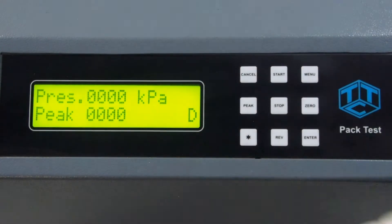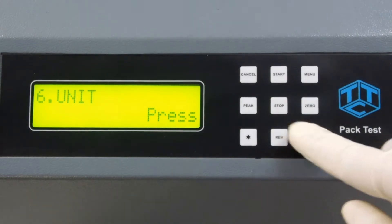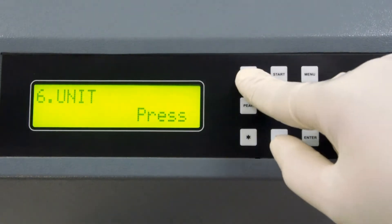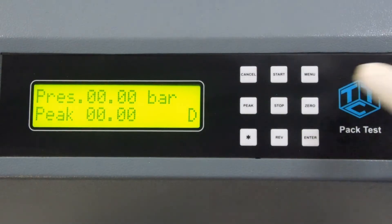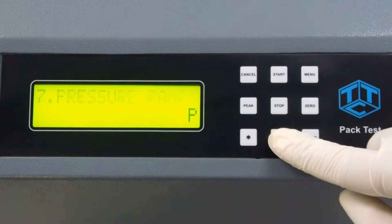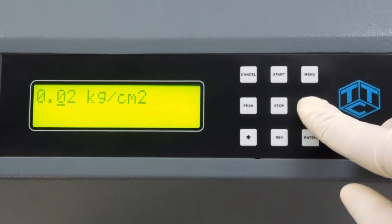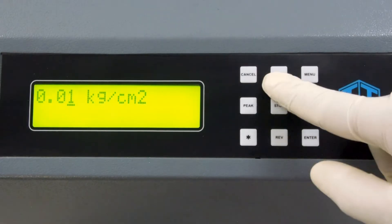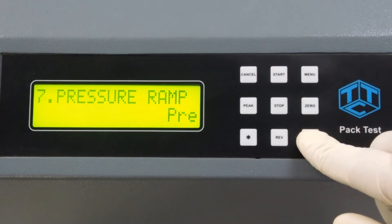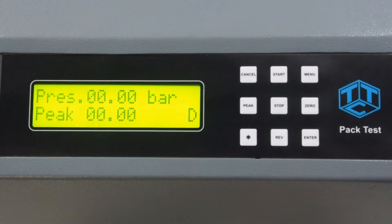If you need to change the test unit, follow the steps as shown. This machine features a special automatic pressure regulator — you can control the pressure ramp rate, or rate of increase in pressure. If you are using big pouches and find the pressure increasing too rapidly or too slowly, you can adjust the ramp rate. We recommend keeping the rate at around 0.01 kg per centimeter square per second. This means if your pouch is expected to burst at about 0.5 bar pressure, it will take about 50 seconds to complete the test. Adjust it only if absolutely necessary.